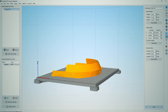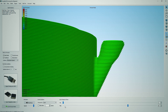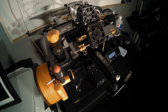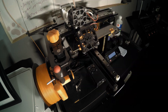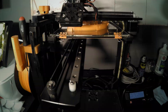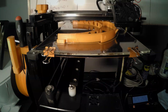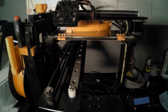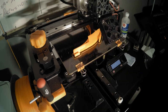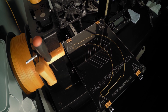The print setup for this was really easy and straightforward. The part fits on a standard bed and no support is needed. Once we locked down the design, we started tinkering with the settings and managed to get our print time down to under an hour with our M2. Unlike the mask prints from the last video, non-anti-microbial filament can be used to print these headbands. PETG filaments are recommended over PLAs for final prints due to their higher resistance to heat and sanitizing chemicals.